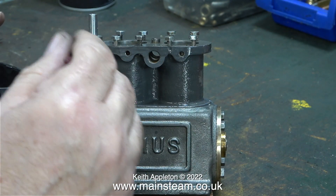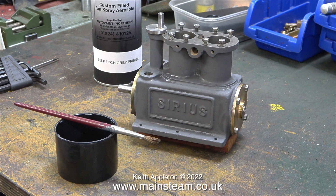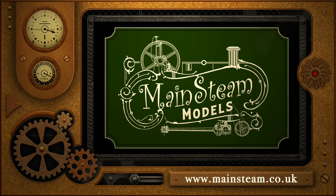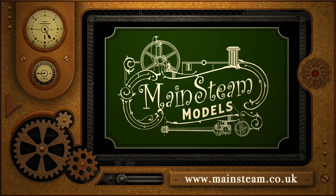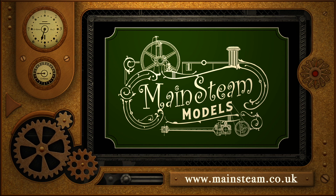After this initial brushed coat I think I will mask up the engine and then spray on a coat of high build etching primer, which after a period of 24 hours will be followed by the top coat colour. That's it for this video — short and sweet and straight to the point. Here's a bonus: you can see the paint drying in this clip. To conclude, I've placed all of the parts in a very artistic pose on the bench. Stay safe, stay healthy, thanks for watching, and I hope you found it useful. Please visit my main steam models website and click on the video playlists section to find other videos and watch them back to back.